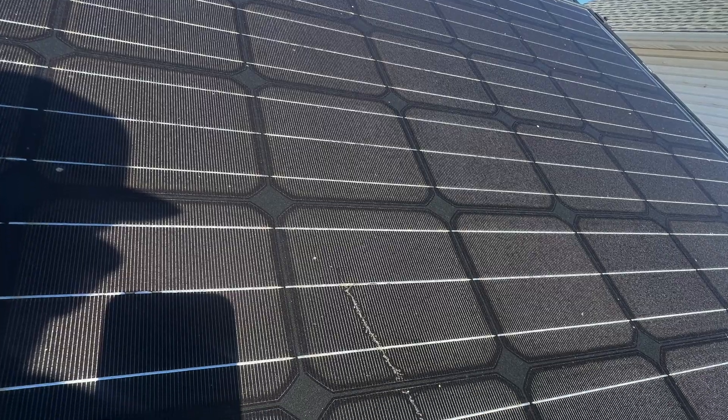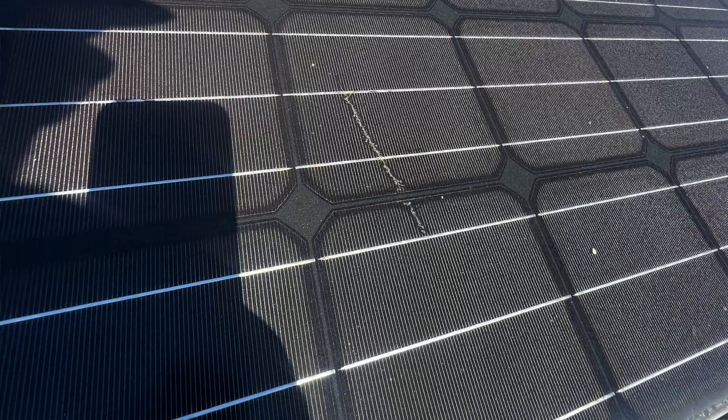The biggest issue with installing these is that solar panels are pretty fragile and you shouldn't walk on them. The silicon wafers — the cells — and the solder points inside: when you step on them it could cause tiny fractures in the solar panel. The panel will still work and you won't know it, but five, ten, or twenty years later it's going to ruin that connection.